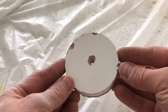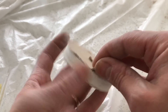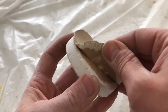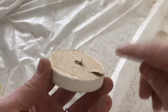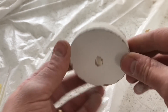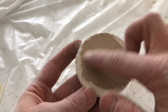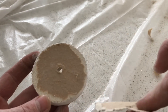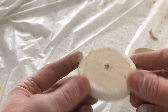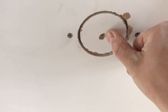Next step is quite important. Get the disc that you cut out and, on the back of the plasterboard, you need to rip this paper off the back of the plasterboard. If you don't do that, you're not going to have any depth to be able to put a little skim of filler on this, and it will sit proud. But once you've taken this paper off the back, just that couple of mil gives you enough gap to put some filler on there.